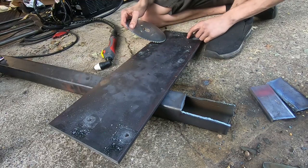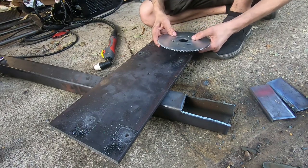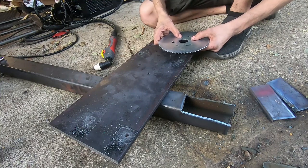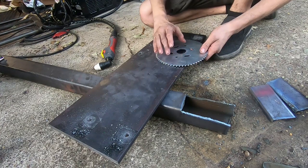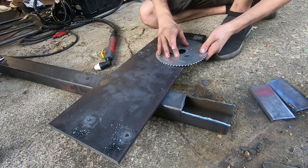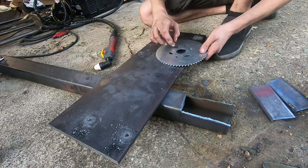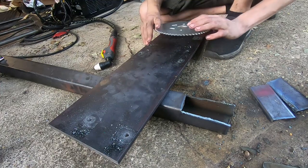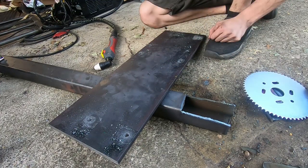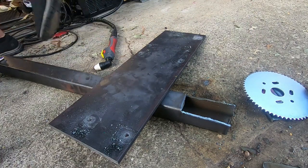The other thing here is you have to make a hub for this, and I wasn't exactly certain where I was going to bolt the hub onto yet. I think that these two circular holes need to be involved in the process of bolting it on to keep whatever I'm doing centered on the center hole here. I'll have to take some good measurements to make sure I actually get that centered, because this does need to be really centered on the axle. They might be involved in bolting it on, but this is getting more complicated than I thought it was going to be.